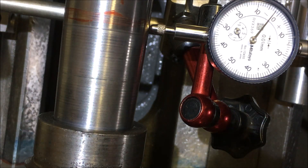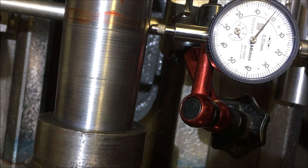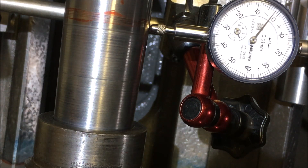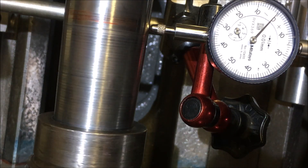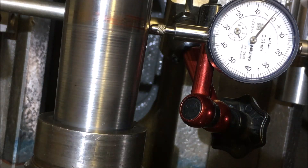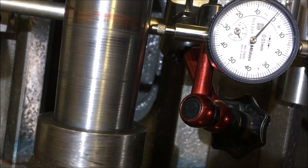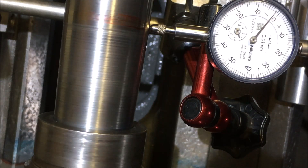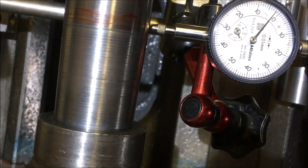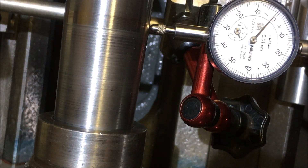Excuse the glare — that's shuffled along, so just tap it so the needle stops migrating. You can see it's two divisions down there; spin it around to see where the variation out of round is. That's minus a half to minus one and a half, so if you say minus one is the middle, we're talking one division forward at the free end — which is four tenths, right smack bang in the middle of the tolerance. So I'm happy with that, and that's the one I didn't want to try to adjust with the spindle bearings — it's just the vertical height.